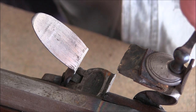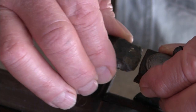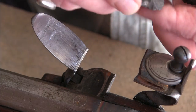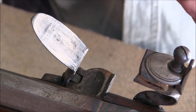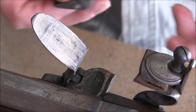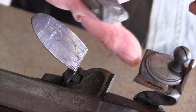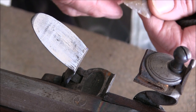I'm using leather in the cock. You can use sheet lead — some people prefer that and even wrap the lead around the flint before putting the whole thing into the cock jaws. I prefer leather, but if you do have a problem with sparking on the hammer, that's something you could try — using sheet lead in the jaws instead of leather. We've taken the large one out and I'm going to put a smaller one in.